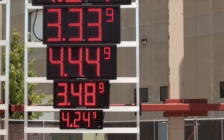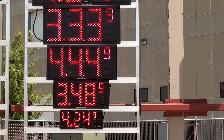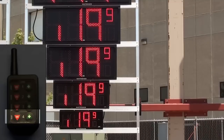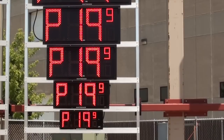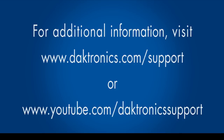With the FuelLight 3000 and 4500 series displays, they also have a built-in test mode. To enter test mode using the FLR3-100 handheld, hold down the plus and minus keys on line four until the display enters test mode. It'll cycle through a bunch of different pieces of information that could be useful when working with the help desk in the case of a service event. Thank you.